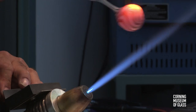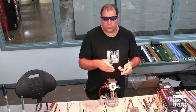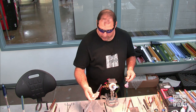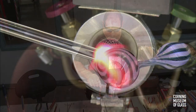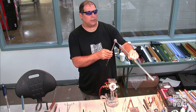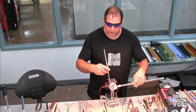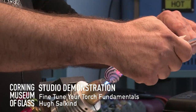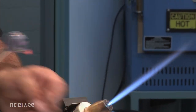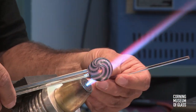I pop the hole aside, blow through it to open it up a little bit — that's why I have it still on the handle, so I can use my breath to open it up. If that hole didn't work out where I wanted it, I could seal it back up and start over again. At this point I'm going to attach this tube onto there, under the hole, and take it off the other piece. I look at it in this direction and that direction — if I don't find these two directions, I don't get a real 90-degree connection, and that's what I want. I'm reversing its axis, so the 90-degree part is very important. I pulled it down so I know where to pull it off with the flame, then fire cut that and do the process over again — pull it thin, break a little hole into it, and seal it back up.